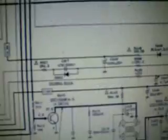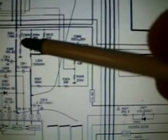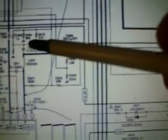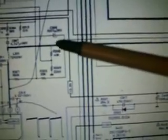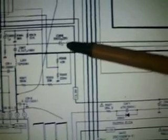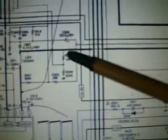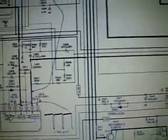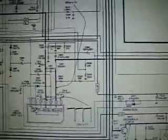This little network here — this cap C305, I already wrote that down, it's one microfarad, resistor, resistor. And here's another one: 3300 microfarad, 25 volts, C306. Those are two I'm going to replace because they bias or modify the drive going to the vertical coil of the yoke. That's the end of this video. Have a great day, bye.